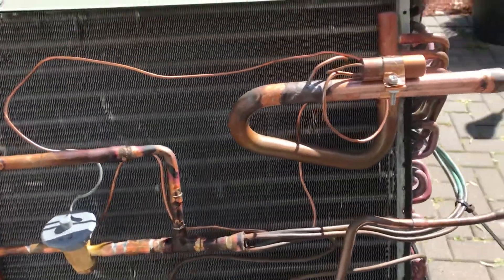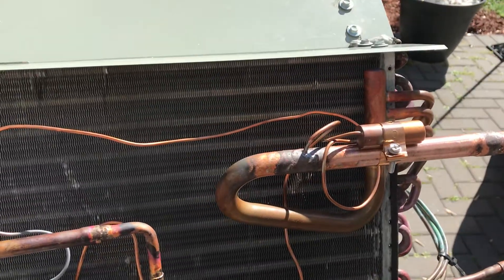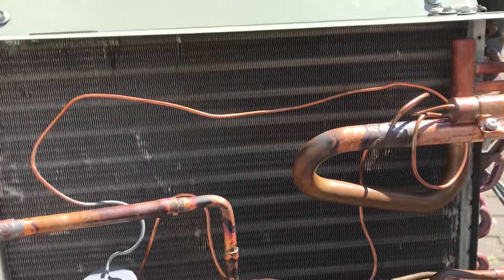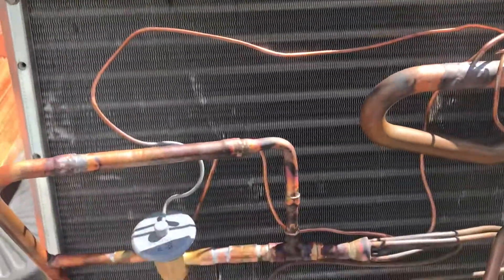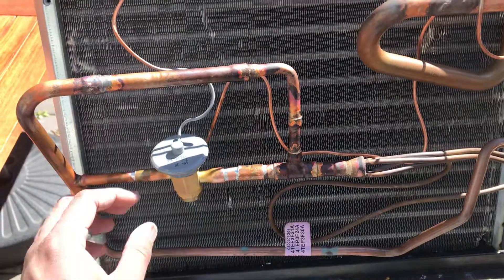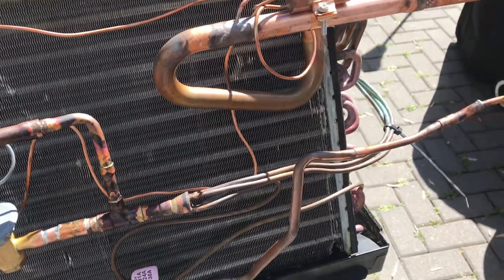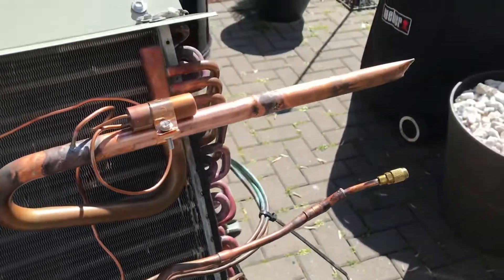This is a really old system. This coil came out of a 2008 manufacture year and she's still going strong. It came out of a burnout unit, so we put a new TXV in and we'll be using a bunch of filter dryers on the suction and liquid lines.